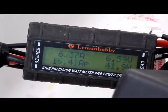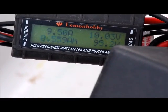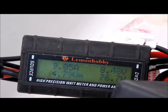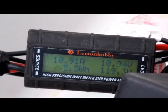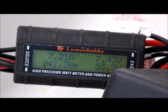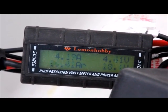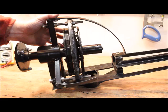What you're looking at there is the turbine with the KT blades. It has very inexpensive eighth-inch thick one-inch by one-inch magnets on it. I think it made a maximum of 200 watts in there — it has 241 watts rated. It might make a little bit more than that. It is hooked up to one single deep-cycle battery and a 12-volt charge controller, one of those little power-plant ones. The power just went out on it because I don't have the wattmeter hooked up to the battery. But that's that turbine.